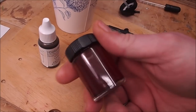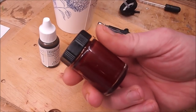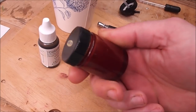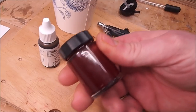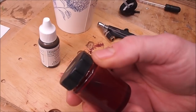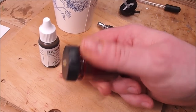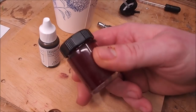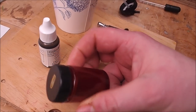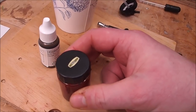I've been mixing up a concoction for the touch-up. Matching the transparent red colors that Gibson uses is never an easy task, for a couple of reasons. Red dyes just naturally tend to be fugitive - in other words, they will shift color over time, due to chemical reactions within the lacquer, exposure to UV and oxygen, and just general fading. They'll start to look washed out. If you take the pick guard off an SG that's 10 years old, you'll definitely see how much the color has changed from when it left the factory - even if you leave it in the case, it'll change.